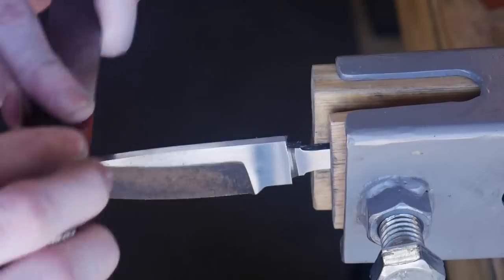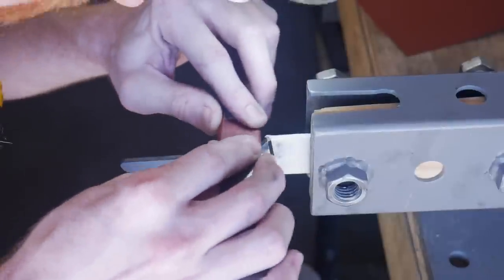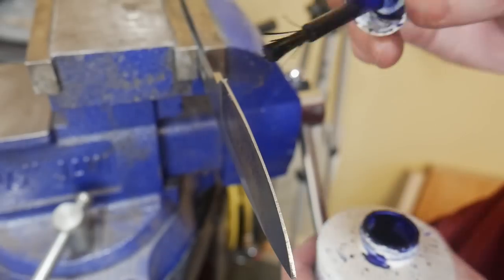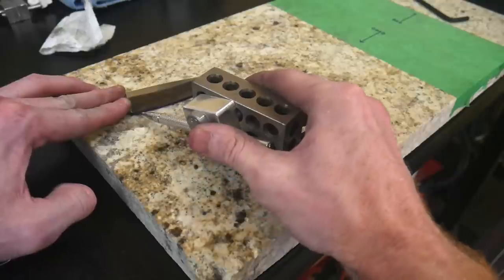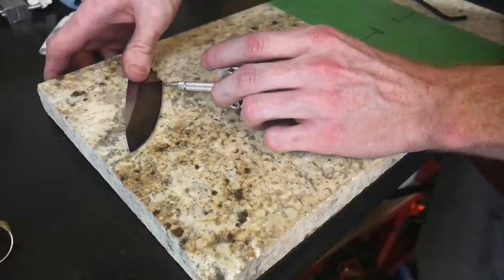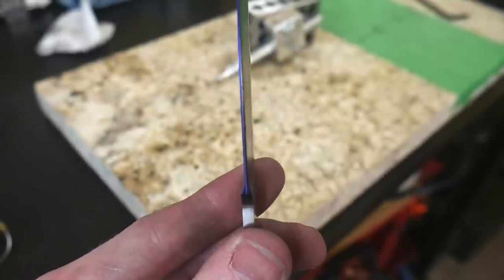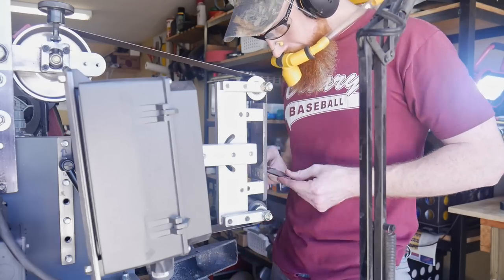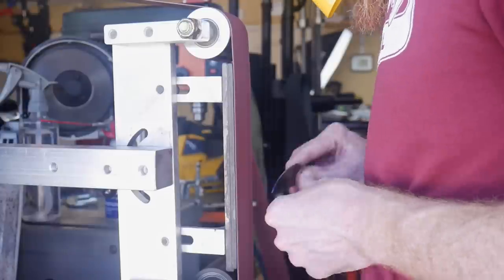Bringing the spine of the knife up to a 320 Rhino wet paper finish, and then getting the choil area at the bottom of the ricasso to the same finish. We'll get a little marking fluid along where our edge is going to be, and then use this height scribe with a carbide tip to mark off our centerline. I like using this height scribe because I can easily go back to it during grinding — I actually remarked that line about three times.